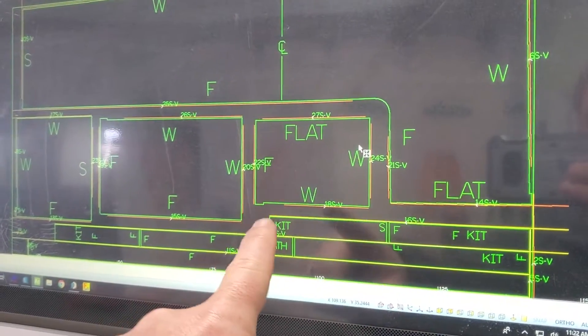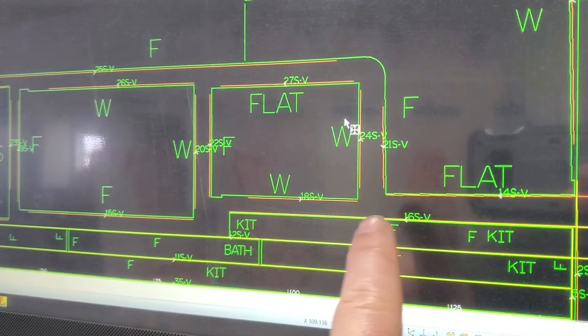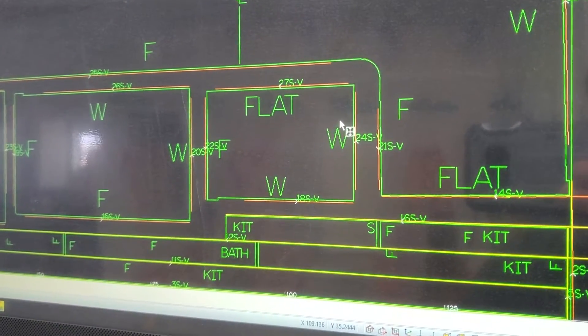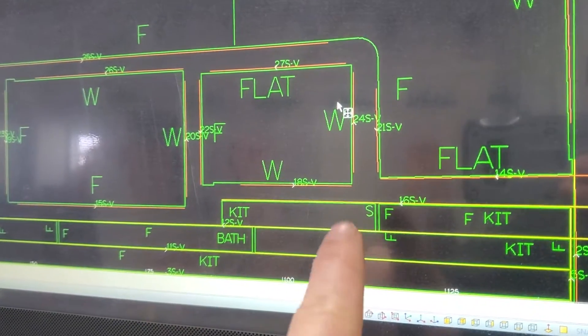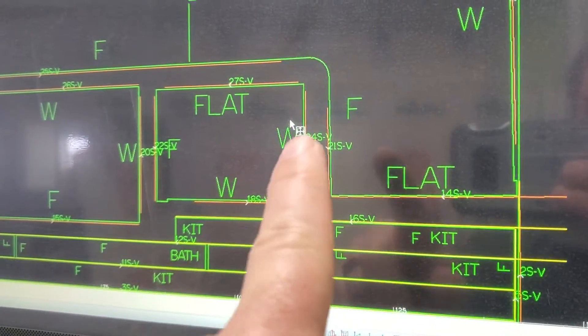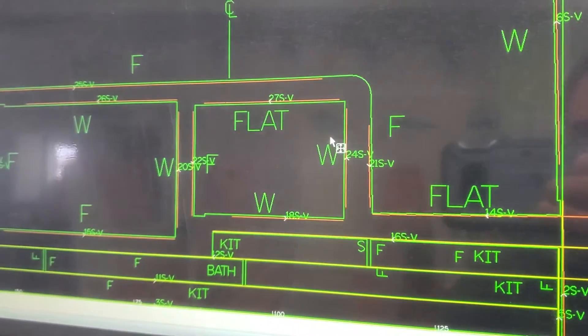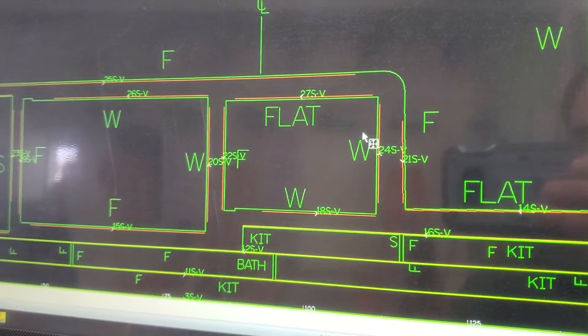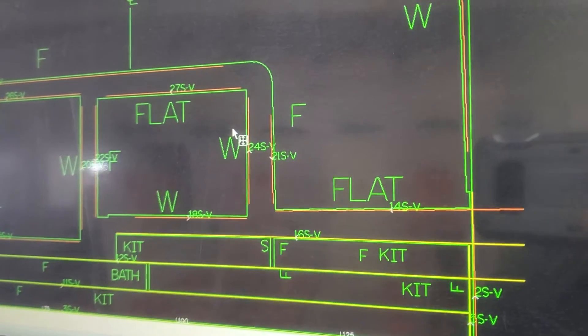So you see here on the cutting screen, you see these little red marks — that's actually the path of the cutting saw. They don't connect in every spot, and that's because the computer knows that if it connects those cuts, you might actually cut into the backsplash or into the main countertop piece, and you definitely don't want that. So you have to come back with a little handwork with the small grinder and just cut the corners out and cut that radius out.